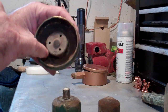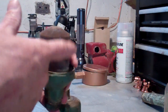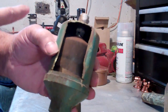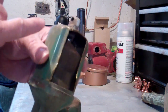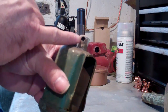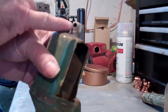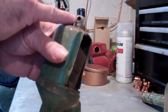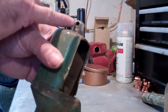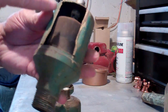How this works is the air gets driven out, goes around this diffuser plate, goes around the cylinder, and exits out the top of the air vent. You can see how the holes — it's really deceiving how they do these air vents. This is not the size of the hole that dictates the amount of air that can get out. You'd look at that hole and say that's got to be a great venting vent, but this is not a great venting vent. It's well made, but it doesn't move very many cubic feet per minute.